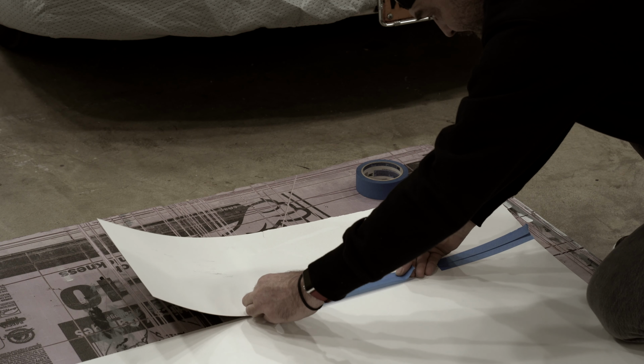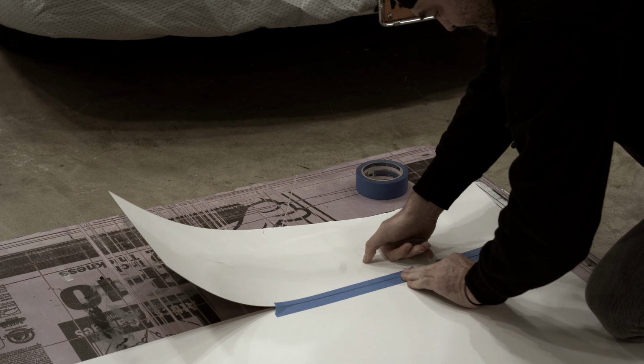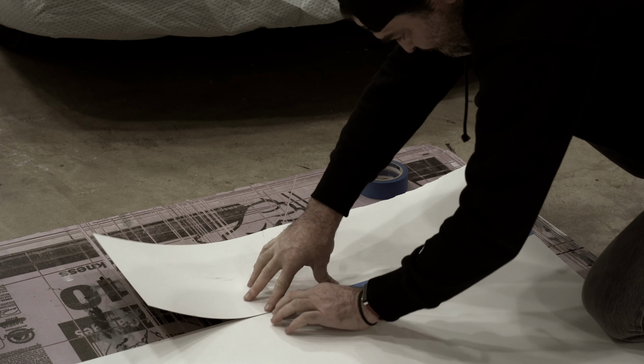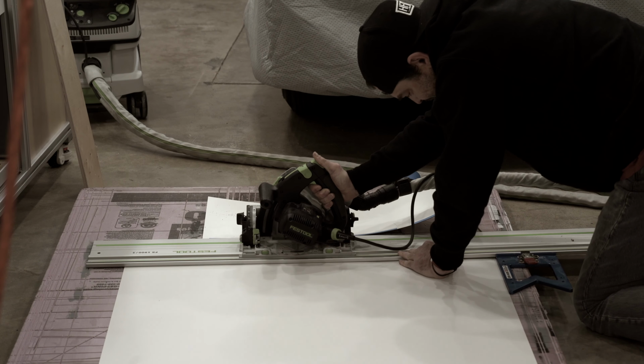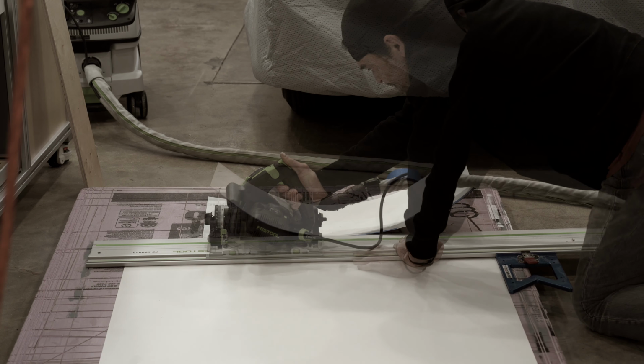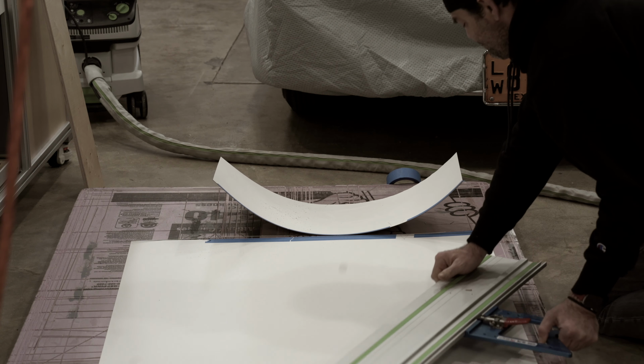I was running short on time, and I decided I was going to have to deal with the seam in the laminate. I did this by taping 2 pieces of laminate together, leaving them overlapped by a couple of inches. I then made a square cut down the middle of that overlap. This left me a seam that should match perfectly once glued down to the surface.